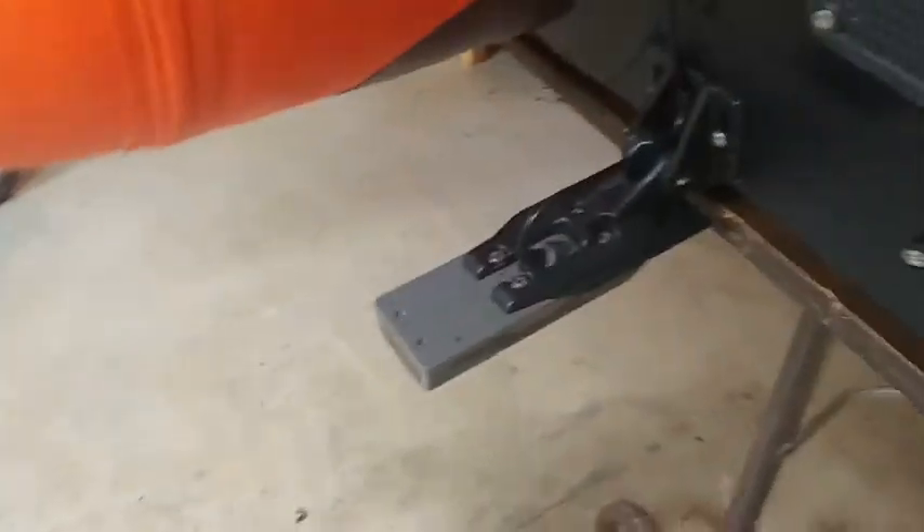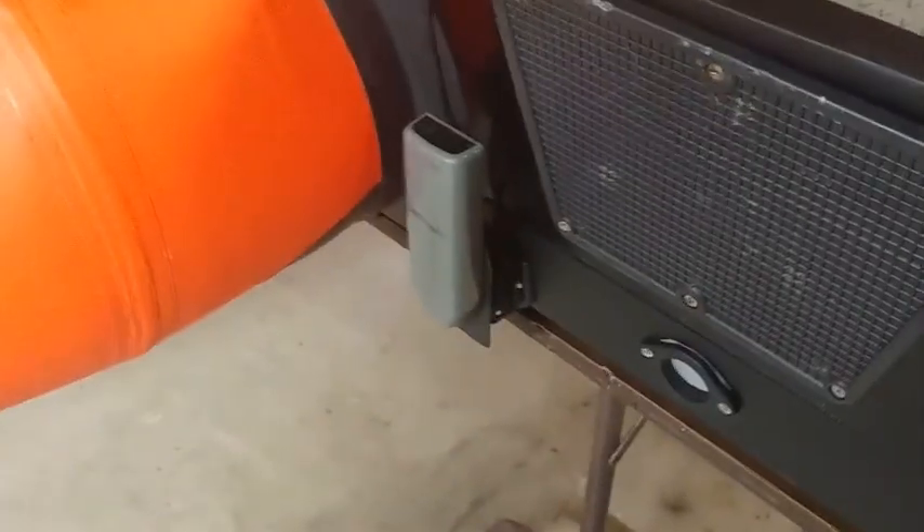For the transducer, I've never liked the idea of sticking it over the side on a long arm to flop around. So I mounted the transducer on the standard Garmin transom mount on the back of the transom foot, so it's in the water when the boat's going fast. You can reach over and pop it up out of the way when you're beaching or launching the boat. I run the cable right over the transom, and it's routed under the floor when I set the boat up to go fishing. It comes out from the front of the floor and there's plenty of slack to connect up here on the front seat to the Garmin.